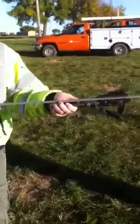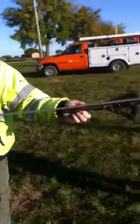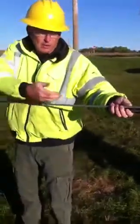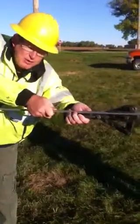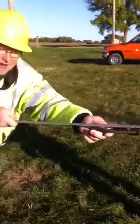The conductor grip is designed to push one direction and pull the other. It slides out and you can pull it tight. We want to get out as far as we can when we're sagging wires so we have more motion of the hoist. We want to slide it out as far as we can. Reach out with your opposite hand, hold the wire, lean into it and slide out to get it out there.